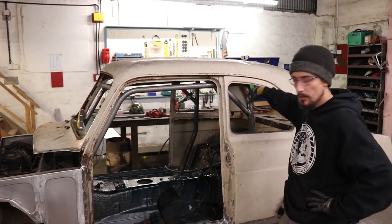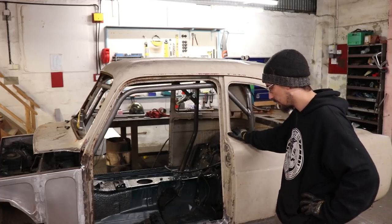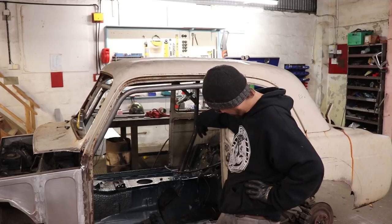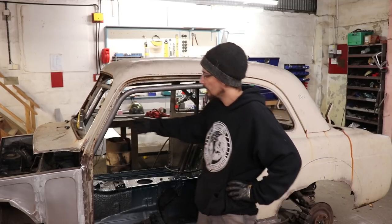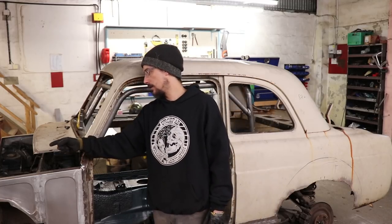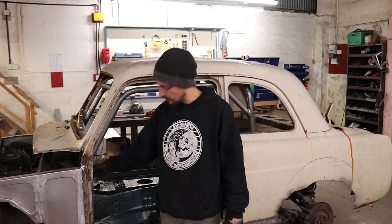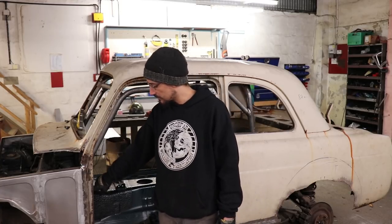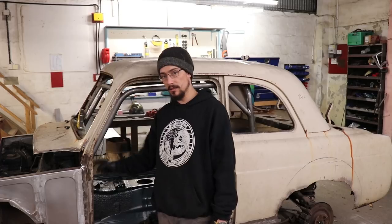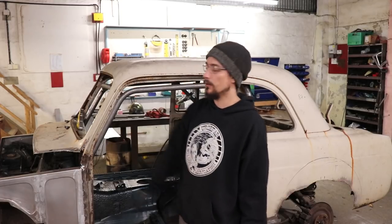Right, so tops are welded all the way around every piece of tube. So now I can stick it back up on the boxes, stick those bars back in at the bottom, potentially weld the boxes fully in. I still need to be able to slide this back and forward because when I do the front, the bars that are going to go through to the front piece that I've put in there, I'm going to have to be able to slide the whole cage back a little bit so that I can get to the bars that are coming off of the back side of this piece coming down here. So I'll slide it back a couple of inches, weld them up, push it all forward, weld the front up.